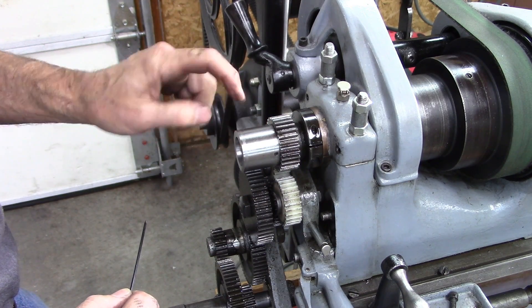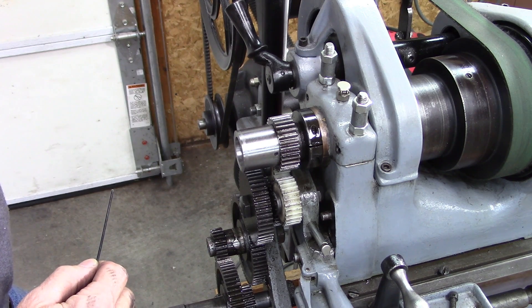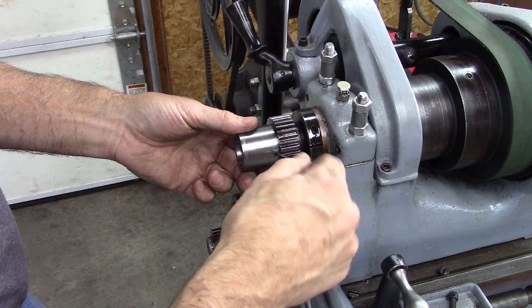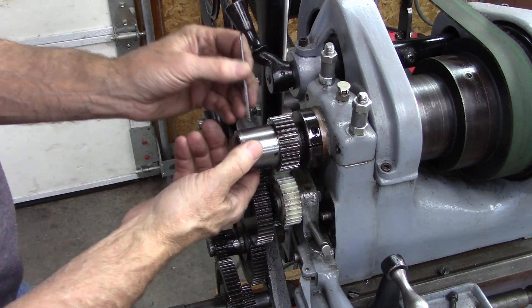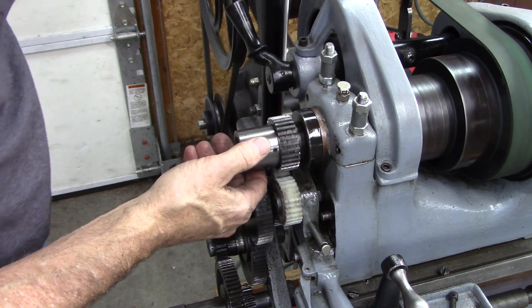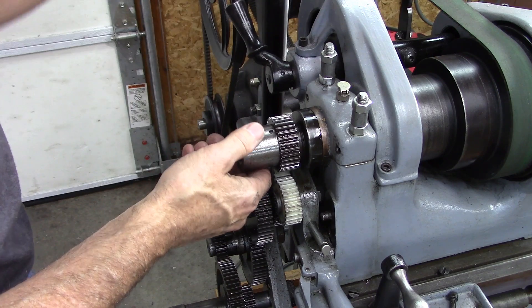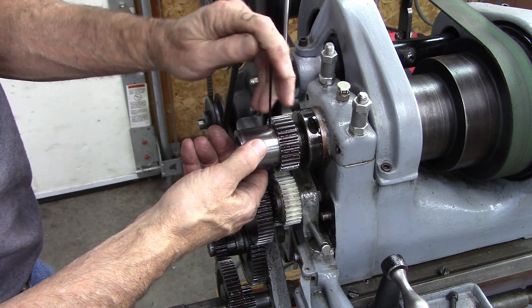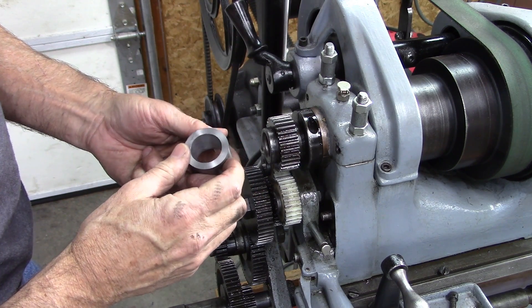I like it. Now I've got to drill a hole for that magnet. It's a metric diameter magnet — I can't remember what it is — but I'll have to make do; I don't have a mill bit that size so I have to drill with a standard drill. It won't hurt to have a concave hole in the bottom as long as the sides are parallel.